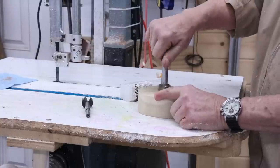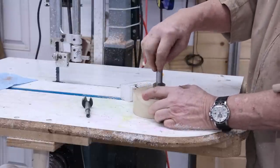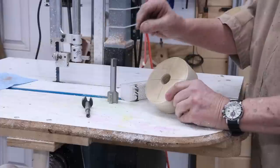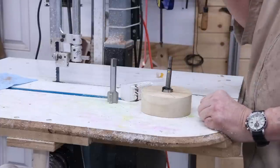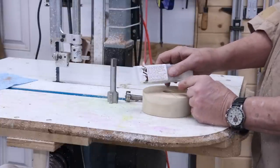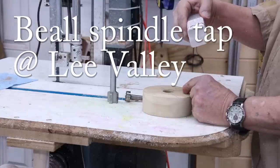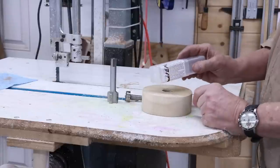And that just threads in there. The threads, obviously, thread right onto your spindle on your lathe, and you can get one with 1 inch, or this one is 1¼ inches. You first drill out with the appropriate size drill bit. Simple as that. All the dimensions for drill bits and the tap sizes are on this container, but I'm sure if you go to the Beall website, you'll find all that information. Newark, Ohio. Trying to find a website on this little container, but anyway, if I remember, I'll put one in the description.